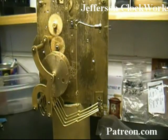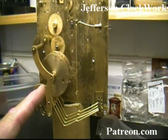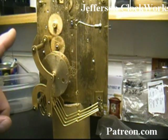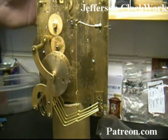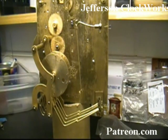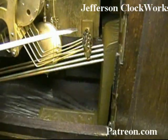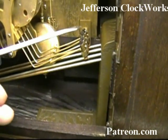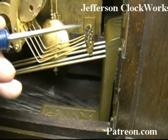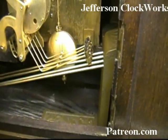Time to put it in position. I'm going to show you a back view of the movement going through the chiming cycle and also the strike cycle. Then I'll show you how to do all the adjustments up front in case you need them. First I'm going to activate the strike. It lifts only three of the hammers — each hammer has to hit the center of each one of its associated rods. If you want it a little louder, get it a little bit closer. If it buzzes, adjust it upwards.